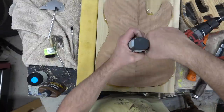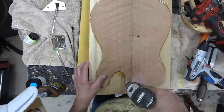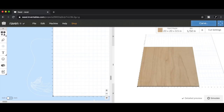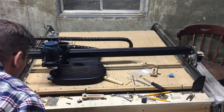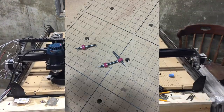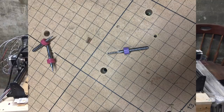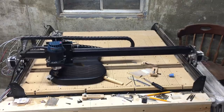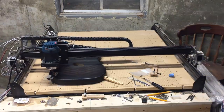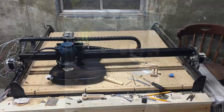Press this on, screw it in, take it over to the wine press clamp and go. Make sure the lines are set — one of them wasn't right so I just moved it over. This is my easel template: I take half of the body and drop it on the left so I've got the center line running through, and then I can route the Raven on the upper side. This took about an hour and a half and I didn't have much luck — I broke five bits. This is a 1/32nd bit and it was snapping off, which was a huge pain. I should have used a 1/16th bit, but then I wouldn't have gotten as much detail work. The router kept stopping so I had to stop and restart. The trick is to not turn off the machine — just pop the router out and put the new bit in. It actually worked okay.